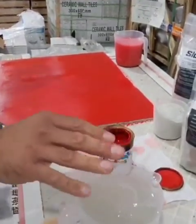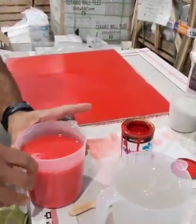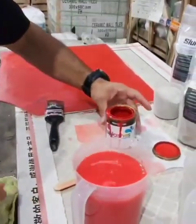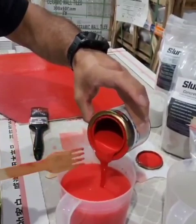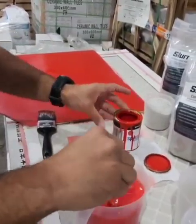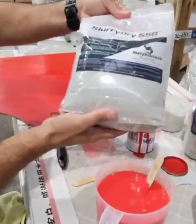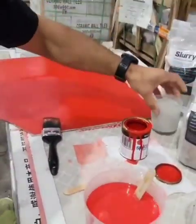And while we're waiting for that to activate, alright, so if the slurry water, let's say there's a bit of paint in there, or the slurry water is too thick for argument's sake. So let's say someone's dropped a bit of paint in and the water's very thick. If the water's very thick, there's no benefit in using slurry sep. We'd go straight to slurry dry. Alright. So slurry dry will solidify it straight away.